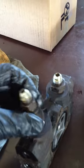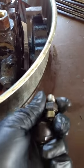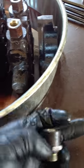When I pulled these — I guess you'd call it a nipple — off of there, I noticed that down the center of it there wasn't a clear shot through. So I opened it up. This is the one that operates the roll back function. I took it off and there's a little restrictor in there. Dumped that out, and this little piece of aluminum was stuck down in the middle of the restrictor.